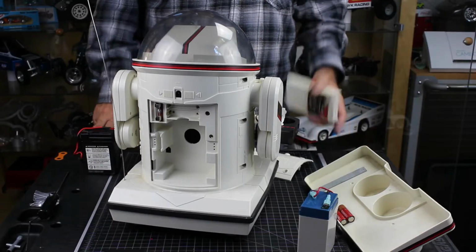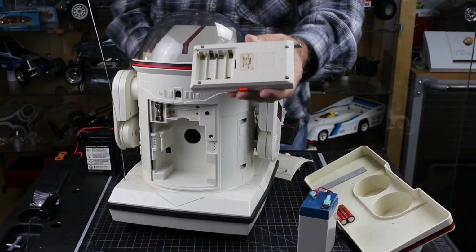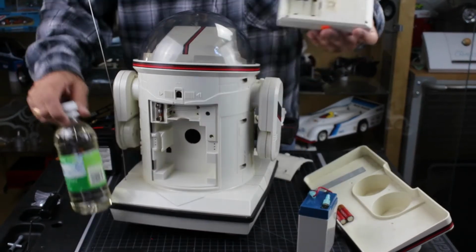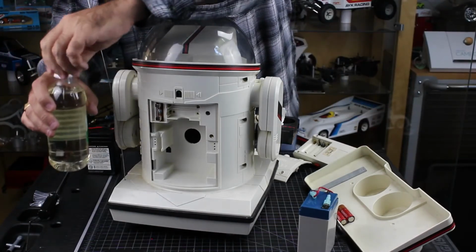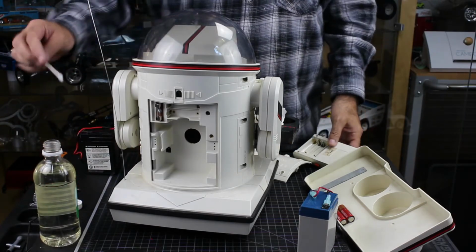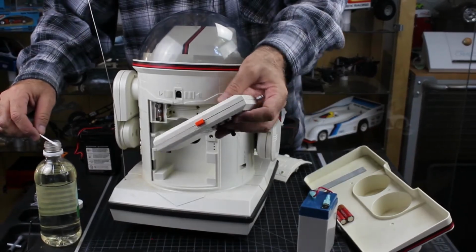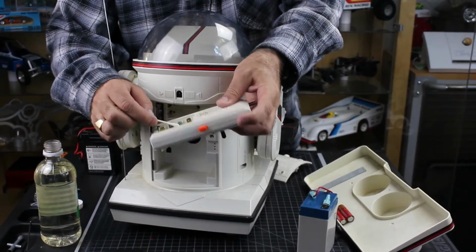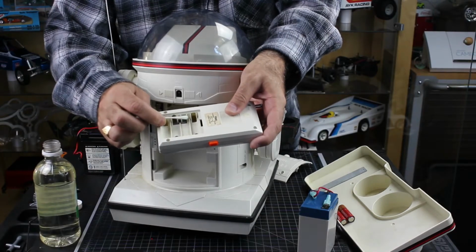Okay, so this is the way I normally clean up some of this corrosion. I use concentrated vinegar, not the type you'll find on the store shelves typically; this is highly concentrated. I usually mix it with water since it's so concentrated, but in this case the corrosion's pretty bad, so we're just going to go ahead, and as soon as you wipe it on, the corrosion just immediately begins to dissolve.